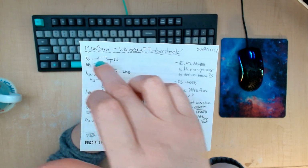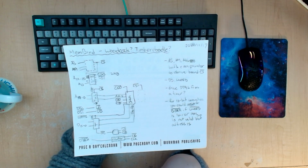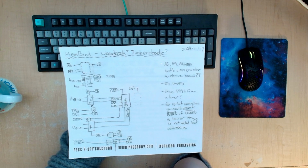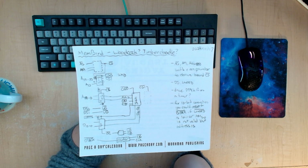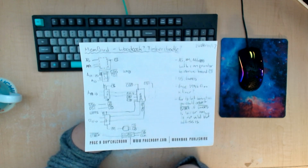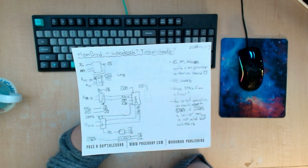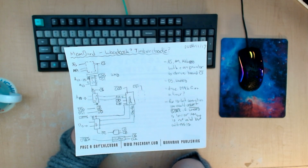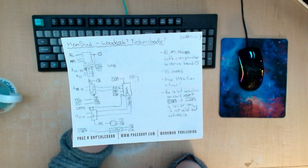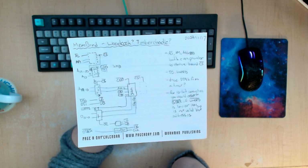When the address strobe signal is active, and the 6 address modifier bits with a particular address code come on to the VME bus, that would essentially activate, it would say, okay, there's a cycle in progress. The address pins would be decoded to figure out if it's an address on this card. It would activate the chip select signals, and then from there we could control either a transceiver or a latch for the address pins. Those would go into the RAM chip.